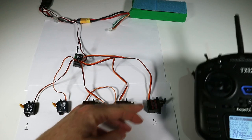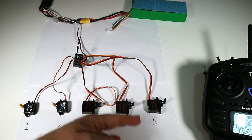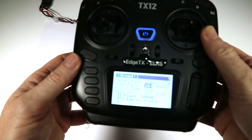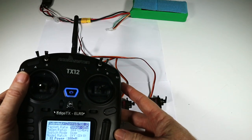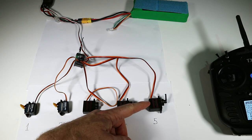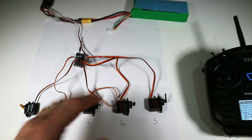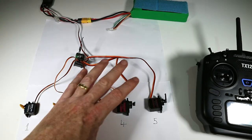The reason it looks jerky is the way it works with these wide switches — it sends one channel every packet, so in order to come all the way back round to this packet it takes like eight packets before it gets there. At 150 Hz that's a bit slow. If I change this to 500 Hz, then you can see we have much smoother resolution. If we go down to 50 Hz, which wouldn't be unreasonable for a plane, that channel becomes awful — you could use it maybe for flaps, but the update rate is just too slow. So two things to consider there, but that's how it works on version 2. Let's update to version 3 and see the difference.